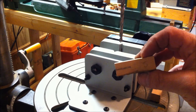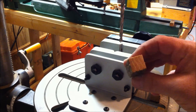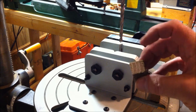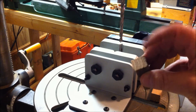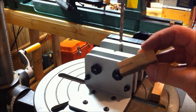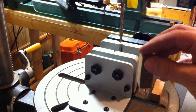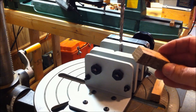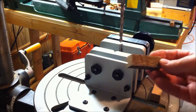What I like to do is — you'll remember I drew that perpendicular line on Sally's blanks so that I can match up the grain — I'm going to start drilling from that end. That's because if I have any blowout, which generally doesn't happen but every once in a while it will, it happens on the far end. I left a little slop on either side of the tube when I cut this blank out, so that will allow me to still be able to trim both ends as flat as possible. Let's get this thing chucked up in the vise and get it drilled out.